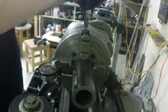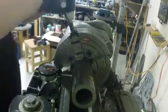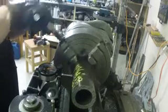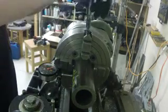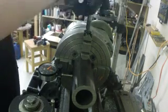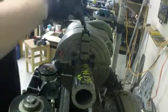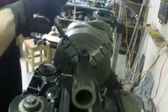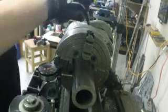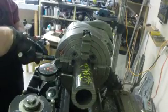Okay, they're looking good. Let's see the 3 guys. These running low. One's running high. Like Adam says, tighten your highs, loosen your lows. Can't state it any better. We need to tighten one a little bit more. About there. What's 3 doing now? Okay, 3's running a little bit high. One.